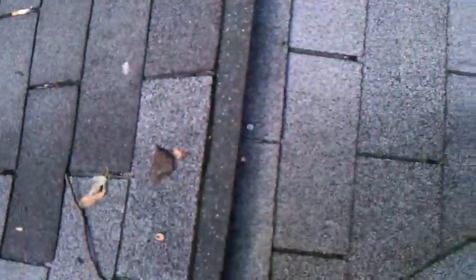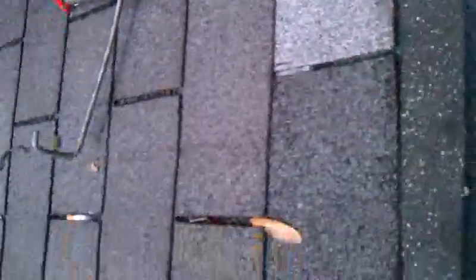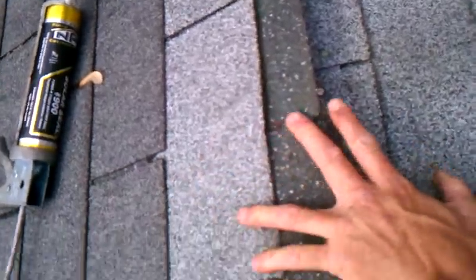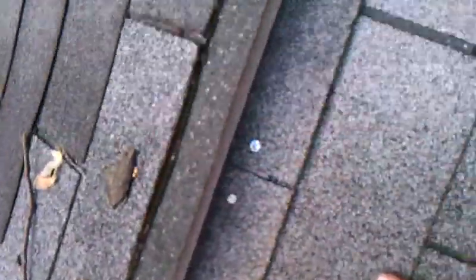It's a common mistake by people who really don't understand water drainage. Also, the person that fixed this roof - they fixed the mistake by the first roofer. Basically, the first roofer didn't put a starter shingle on. Looks like he put one on right here at the valley, but forgot to put the rest of the starters across the bottom. A bad thing that this roofer did was he used drip edge for a pan - not a good idea. They've nailed too high, or they haven't even hit the wood, which is probably why those shingles are raised up like that.